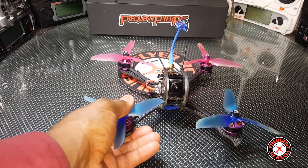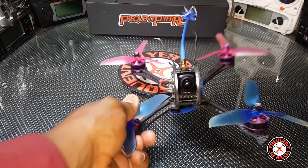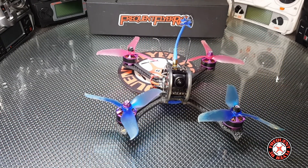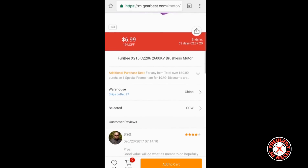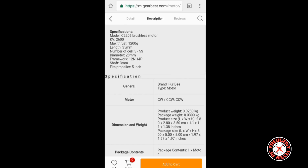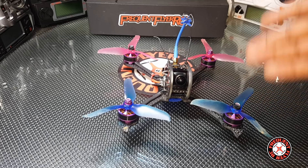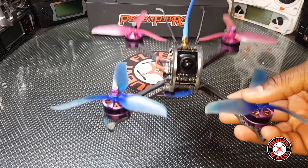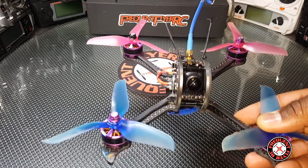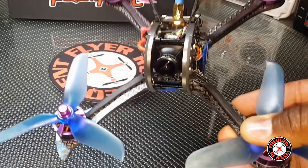So this one is slightly higher KV. The FuriousFPV Dark Max is capable of taking 5S and 6S, and I was saying this one takes 5S or 6S as well, but people were disagreeing — saying all the components are 6S capable but not the motors. I did my research and it seems like I was partially right. These motors are actually 5S capable, but I see no problem going to 6S, though I won't recommend that since the motors are listed as 5S. A 4S is really all it needs, and the jump from 4S to 5S is pretty substantial.